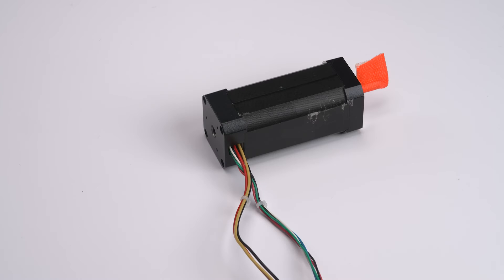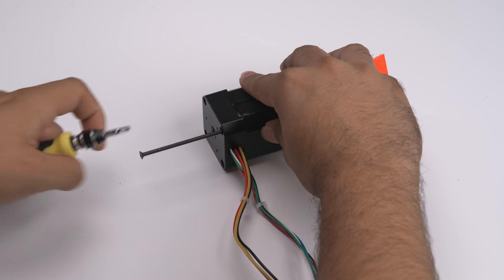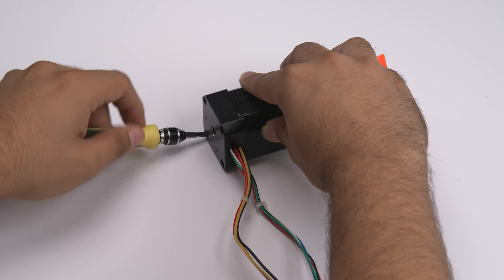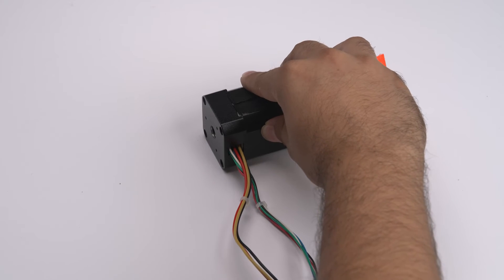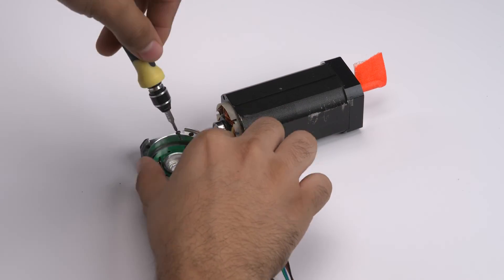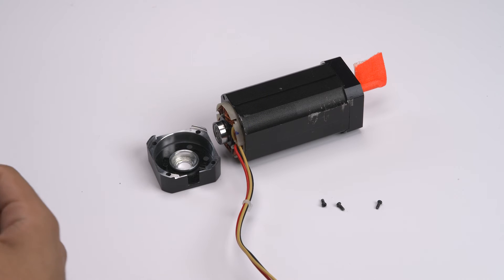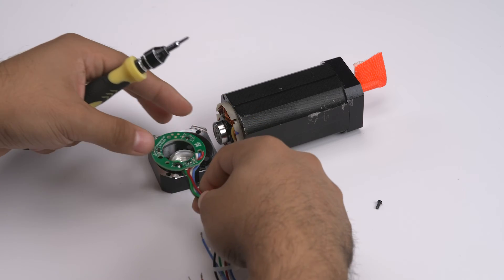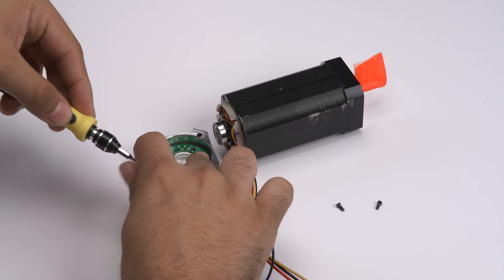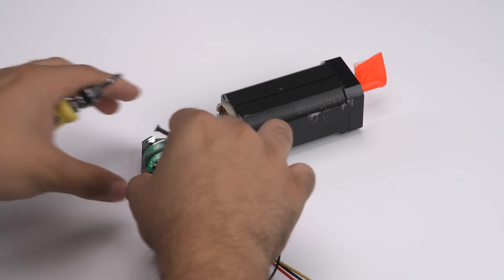Let's get started! We start off by replacing the sensor board on the motor. First, remove the four screws on the bottom of the BLY174S motor to take the motor apart. The main area we are looking at is the backplate opposite to the rotor where the connections are coming from. This portion of the motor assembly contains the Hall sensor board we are going to replace. The sensor board is attached to the backplate by three screws; removing these screws will allow the PCB to come loose. Once loose, we can remove the current board and replace it with the TMAG5115 EVM. Note that there is an alignment hole in the EVM — the plastic will have a peg that aligns with a notch on the EVM, and the cables must face the motor plate opening to allow all the cables to have an exit. Once seated correctly, reintroduce the screws to hold the EVM in place and reassemble the motor.